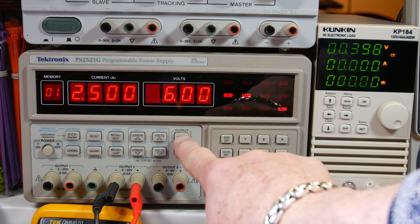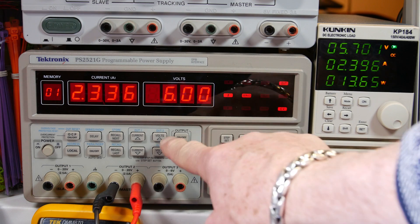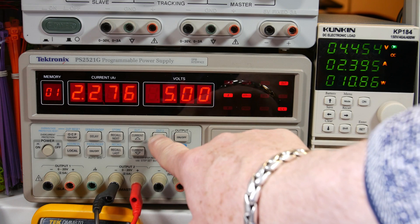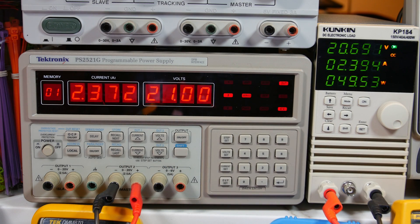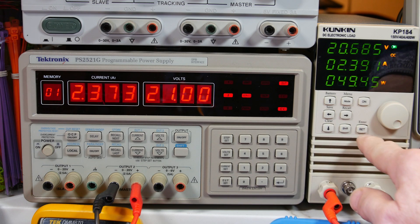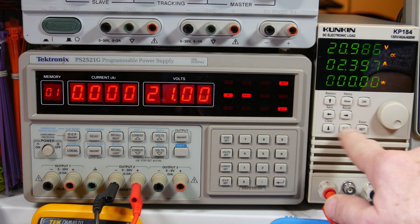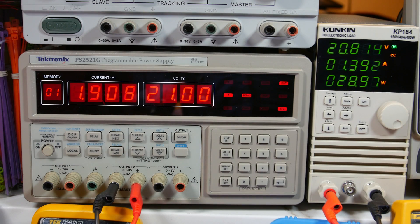Okay, turn it back on. Now it's putting out no current and sitting at 6 volts. Let's turn this on — it's almost maxed out there, so it can't really take much more. But now watch: it doesn't matter if I take the voltage down. Constant current. Whether it's 2 volts, 4, 5, 6, 7, 8 — go up to 14 volts, go up to 20 volts. That's kind of the limit on this output — 0 to 20 volts and 2.5 amps. I can't lower it while it's on, so I'll drop it down to 1 amp. Turn it back on, set it. See? It's just constant current. That's constant current.